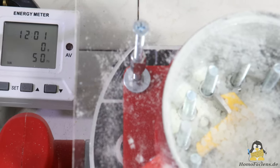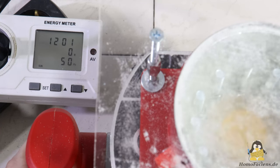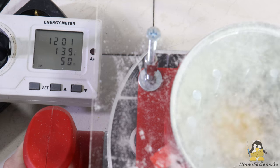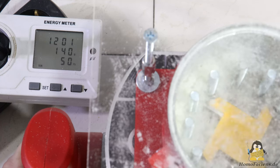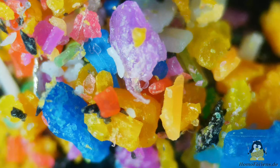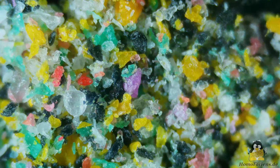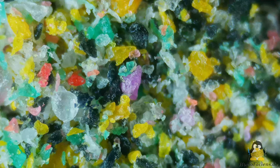It has already been said that the grinding process is ruled by chance, and what is going on inside the can is a bit more complex than shown here. Let's take a look at the machine parameters, although these should not be overestimated for the proof of concept prototype. The milling motor runs at the lowest level and consumes around 140 watts of electrical power. With this setting, the chuck rotates at around 13,000 revolutions per minute when idle. The grain size is significantly smaller than the granules obtained with the blender and sieve in the previous video. Even though there are still many points that need to be optimized for higher material throughput, in principle the whole thing works and I can obtain raw material for my further research into the direct granules extruder project.